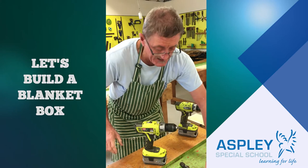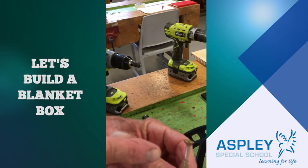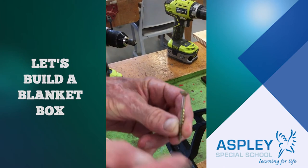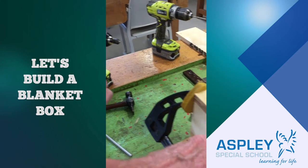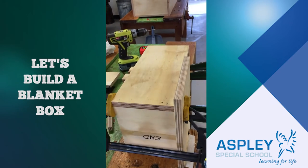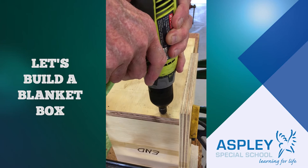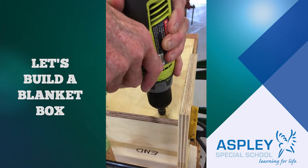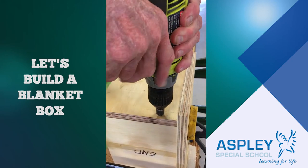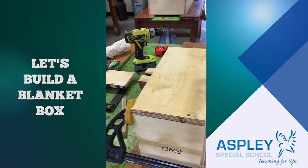This is important. Let's get in close to this screw to have a look at it. This is what we call a countersunk screw. It's got a V shape there and it's designed to go down flat so that it doesn't end up as a bump above our work. So to get it down flat, we use a countersink drill bit. We drill it in like that and that spreads the top of the hole out. I've got to go down a bit more there — even a bit more.